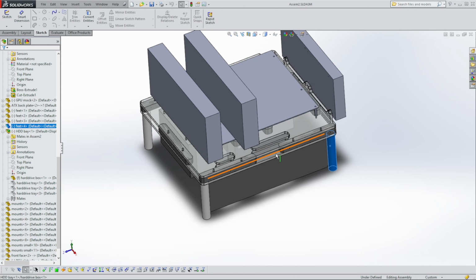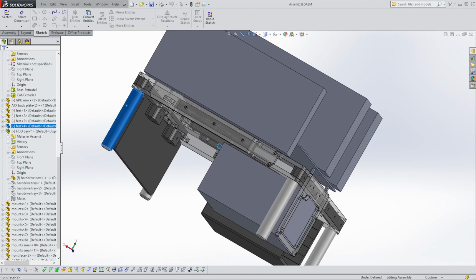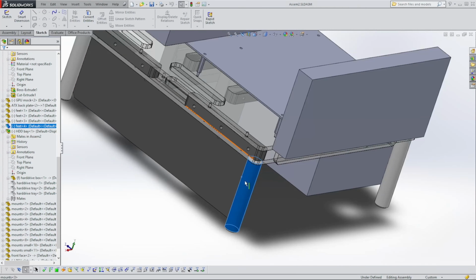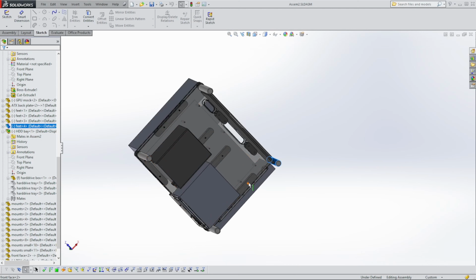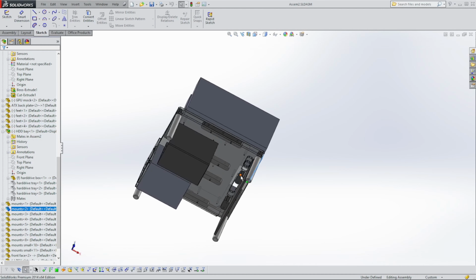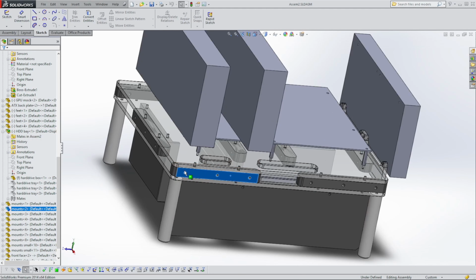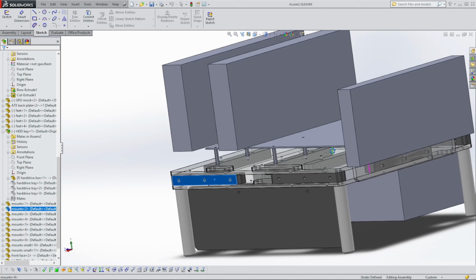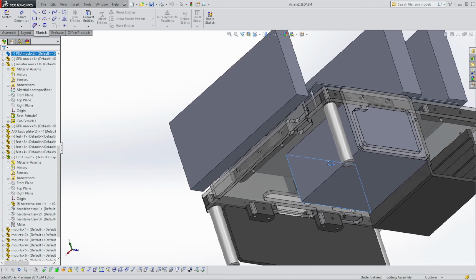Okay. We gotta laser cut these two pieces and this front plate here for covering up all the wiry mess that will be there. And then we have to 3D print, let's see, 1, 2, 3, 4, 5, 6, 7, 8 of these standoffs, I'm gonna call them that, and then two of the smaller ones. I gotta press brass fittings into all of these with a soldering iron, and then we gotta laser cut these two brackets, one for the radiator and one for the power supply.